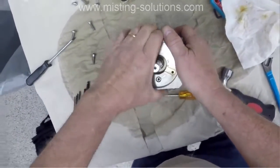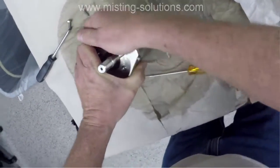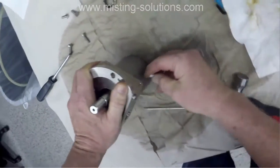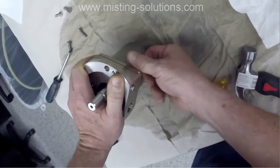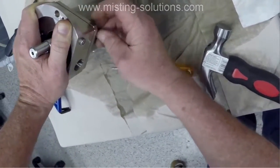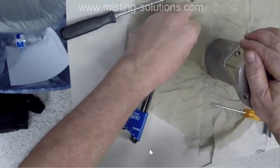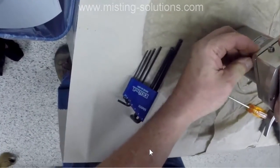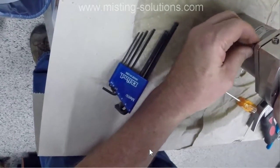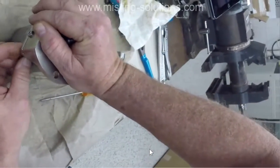You know, as I take more and more of these apart, I'm finding out that it is either piston wear, shoe wear, piston shoe wear, or valve plate wear. And I do successfully rebuild a pump. You'll see in the next video me looking at actually 3 different pumps that have been taken apart, and I take a few pieces from here and a few pieces from there, and put together a good solid working pump again.